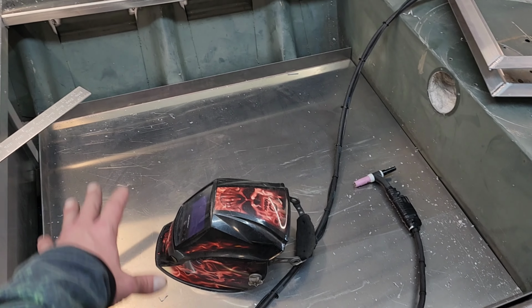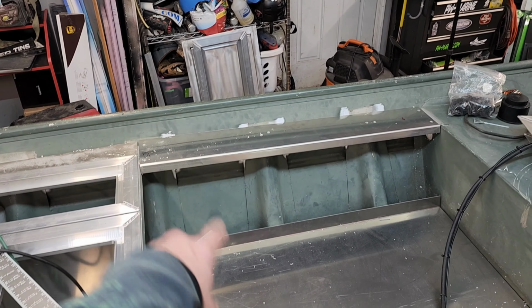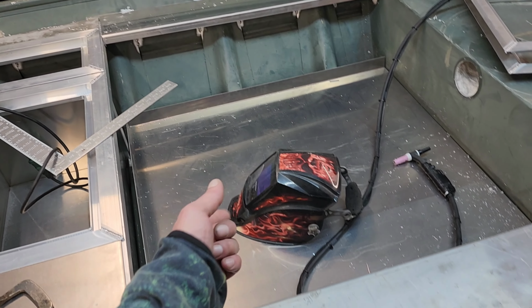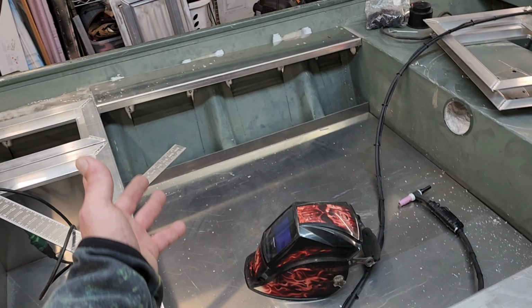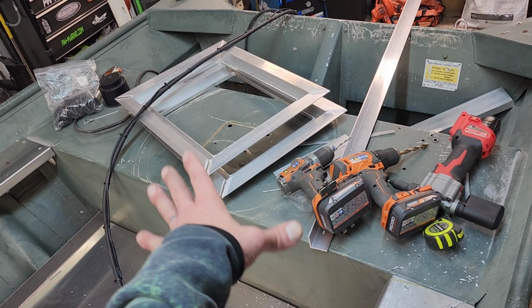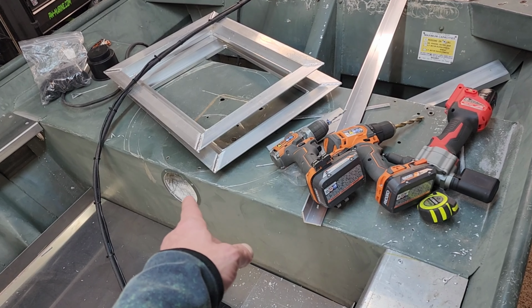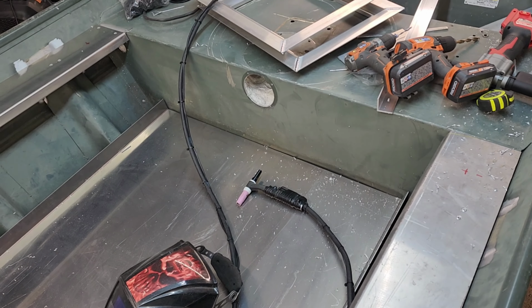And before I do that, I wanna put some foam up underneath here. That's all the foam I have left over there, and it's all 1 inch. This is going to be a big gap underneath here. It's going to be, you know, 3 inches probably of the rib height to the floor, and I don't want to burn up all that foam, and it's probably not enough to do it. So fortunately, what I'm going to have to do next is cut out these two hatches that are going to drop on the port and starboard side of this back bench seat. I'm going to go ahead and cut those out and try to cut that foam out of there, and I might be lucky and be able to use some of those foam strips to fill up this floor right here. Let's get back to work.